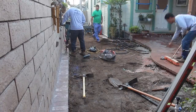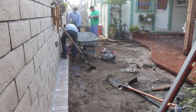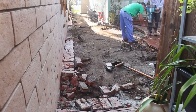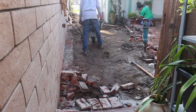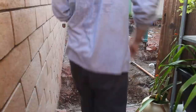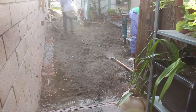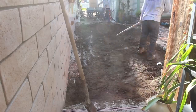I'll run my 12-inch diamond blade and cut through the mortar joints because I don't want to loosen up the other brick behind that point. Now this footing and brick soldier course along the property line all comes out. They have a channel drain here with some brick against it — we're going to remove that brick as well because we want a straight grade slope from the existing patio to the side yard so the water can go into the channel drain. Whoever did this brick and concrete work before did a pretty good job — you can see the rebar sticking out of that footing where the brick was setting.